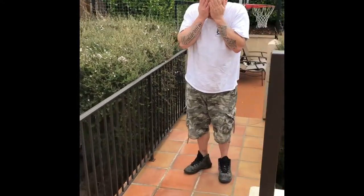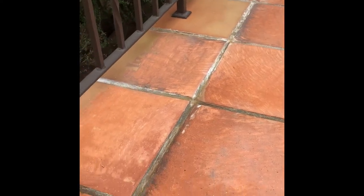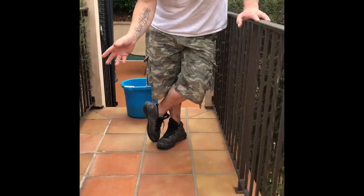I'm completely baffled by this. But all this can only lead to problems — if there's water dripping here and this is the roof to the living room down below, at some point this is going to become a real problem. So the purposes of this video: elevate your pots and make sure they're sealed underneath or they'll start to get calcium and hard water buildup. Also, once we figure out how to fix this drip, I'm going to pop all these damaged tiles out and match them as close as possible — these tiles are from the 80s — and replace them to at least get it watertight and get it back to attractive and nice.